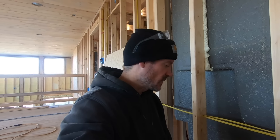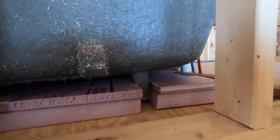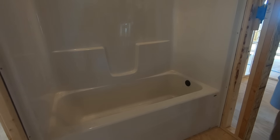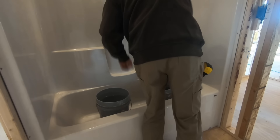Now that all those pieces are in, I used a two-inch piece with a one-inch piece over the top, and that gives me the right amount of space. I hadn't figured this out prior — I just had a bunch of leftover insulation from other projects. They do make four-inch and three-inch pieces, so you could get one full piece if you prefer. With that all in there, I have about a not-quite one-inch gap under the tub. The tub bottom slopes a little, so there's slightly less space in some spots.